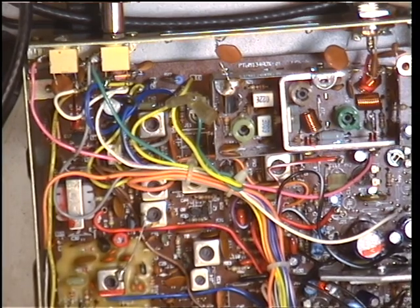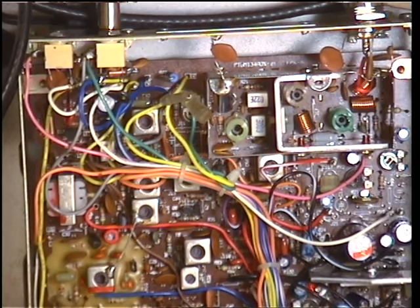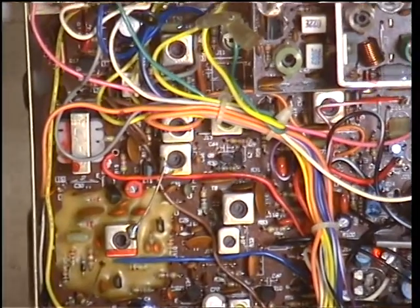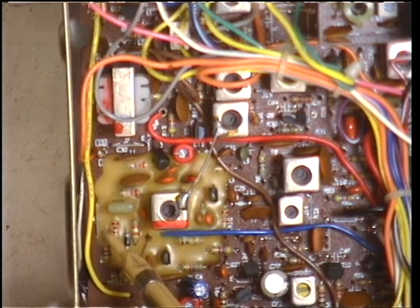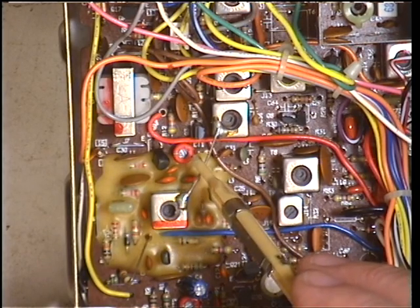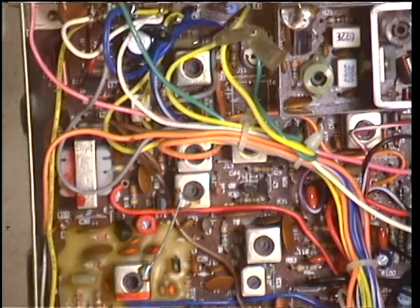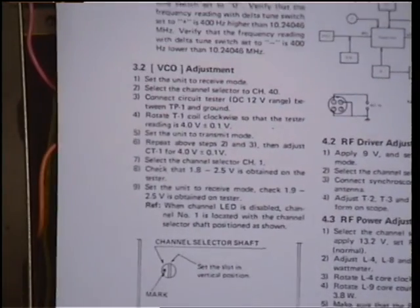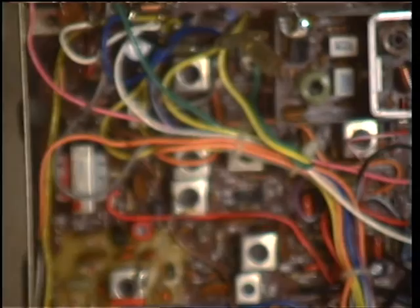As you saw there, the test point — I'll get that yellow tool back — it's the far side of resistor 4. I'll just zoom in a bit to make that clearer. Far side of resistor 4, then you've got T1, and then you've got CT1. So that's the VCO settings as I showed you just there. For those of you who can take a snapshot of that, those are the instructions.